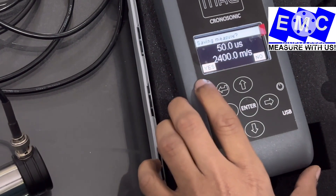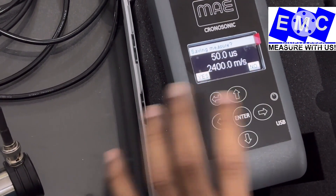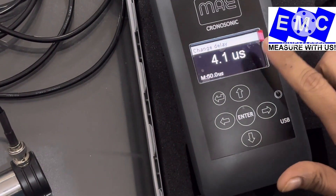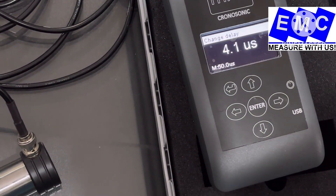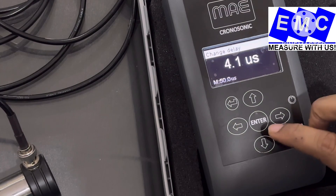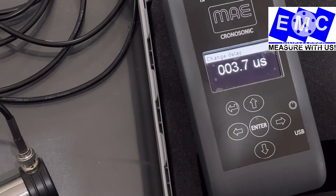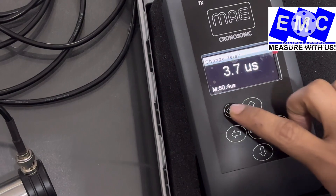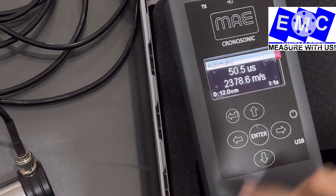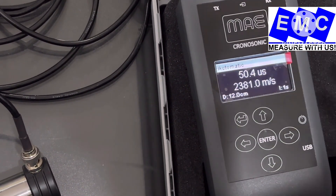We will go back. If you want to save the reading, go back from this button; if you don't want to save, go back from this other button. We don't want to save right now, so we go back and go into Calibration. Here is Probe Delay — we have to change it. It is showing 50.0, but I need 50.4, so I have to reduce the probe delay by 0.4. Right now it is 4.1, so I will set it to 3.7. Now I press Enter. Here you can see it is showing 50.4 microseconds. Going back to measurement mode — the reading is showing 50.4 microseconds consistently. Now our instrument is calibrated. Now I will show you how to take a reading in Manual mode. In manual mode it shows 'waiting trigger' — you have to press the Up button each time while taking a reading. If I press it, here you can see 50.3 microseconds. If you want another reading, press the button again — it is showing 50.4 microseconds, the correct reading.